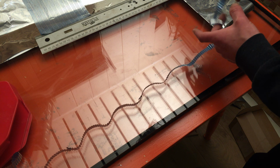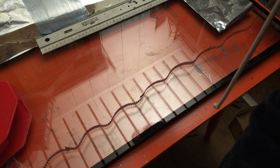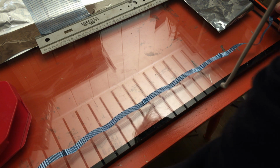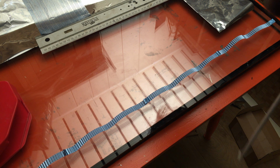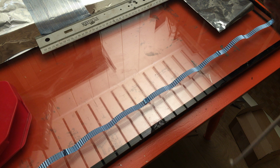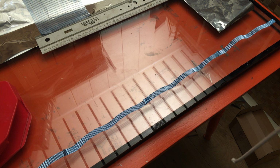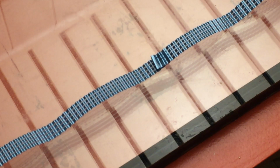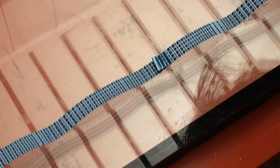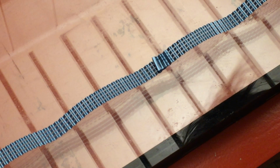So this is 9 micron aluminum foil. So this ribbon, if I would use this, would be too high of an impedance. I think 5 ohm or something, maybe higher. So I could get away with only 3 rows. Now you got like 4 traces, I could get away with 3. I do like the blue somehow. It's kind of cool.